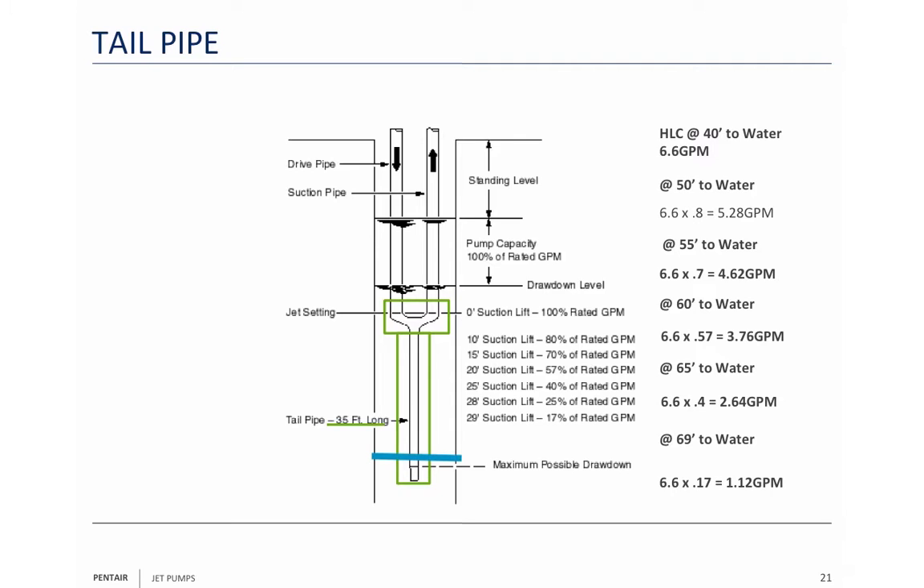At a time when you would normally be out of water, you're 29 feet below the jet and still getting flow. The pump stays primed — what will happen is it will draw down until it can't pull any more water in, but the pump stays prime. That necessarily is not a good thing because you're deadheading the pump, but you're not going to lose prime. So the tailpipe gives you two things: you'll never lose prime, and you can draw water below what the jet would normally draw from. A tailpipe gets used on a four-inch jet, not on a two or three inch, and is used in areas where you have a fluctuating water table.